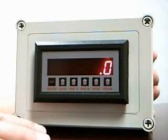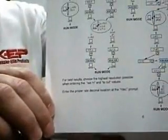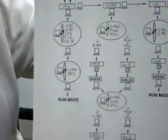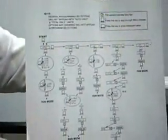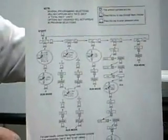Finally, let's take a look at some of the modes of operation in the setup menu. In the user manual, you'll notice a page that has the basic menu organization for this instrument. It begins in the upper left with a location where it says Start, and it shows in a little pictorial form the particular key that must be hit to move into the menus. We're going to navigate through this — it would be best if you follow along in your user manual as we proceed through the setup of the instrument. We're going to configure the flow rate for a 4 to 20 milliamp input, reading in whole gallons and gallons per minute rate.